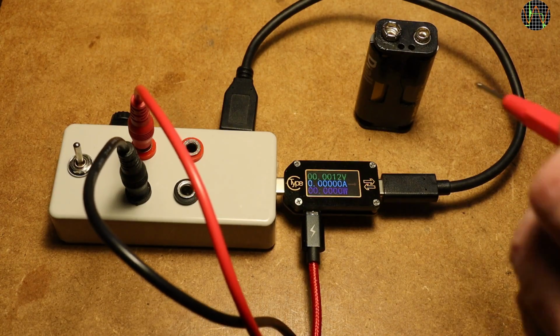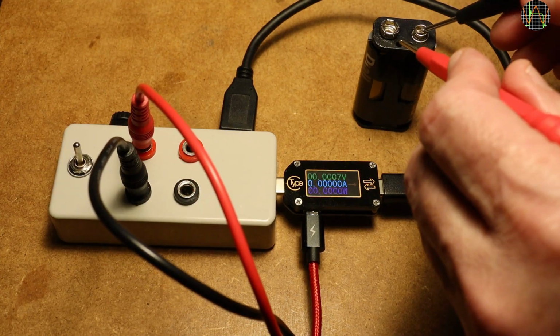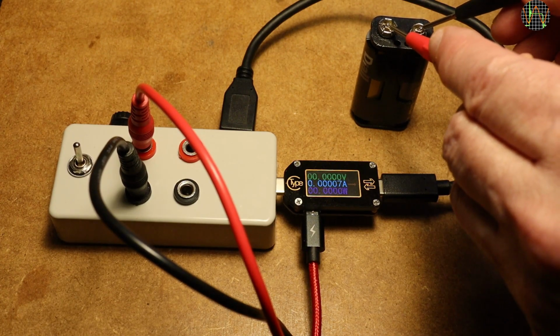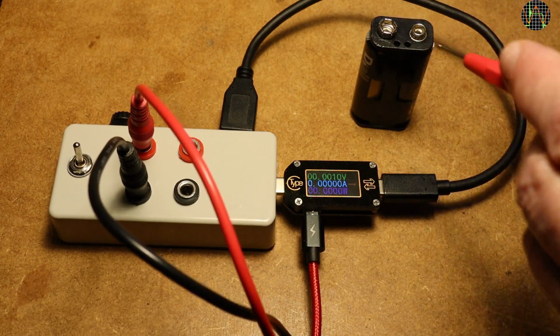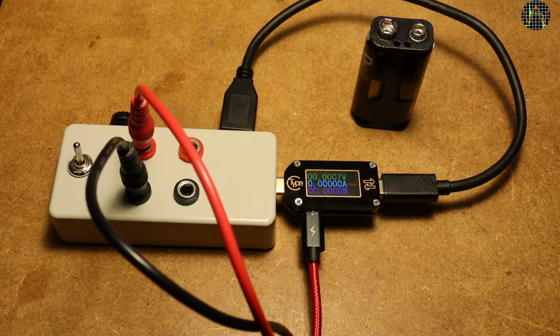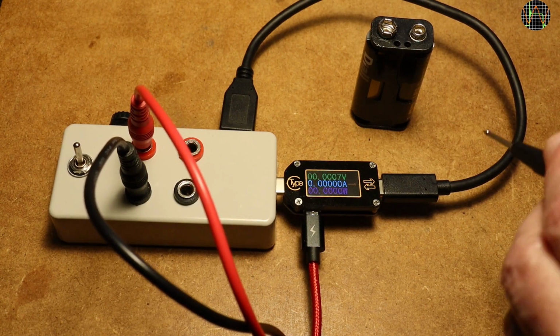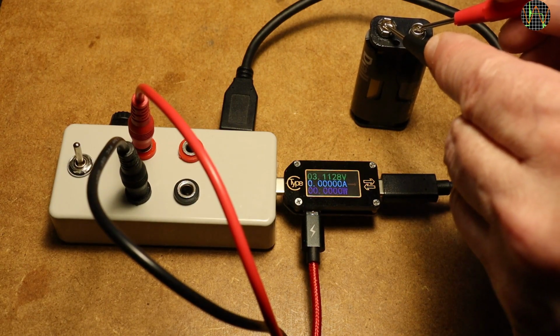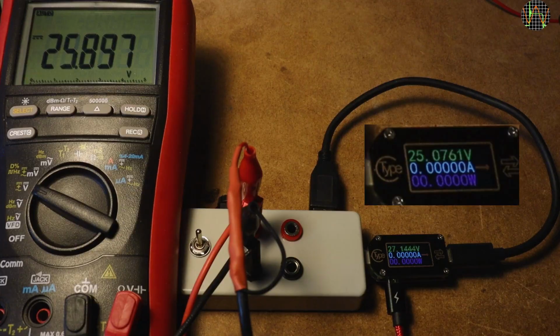At the beginning, you have seen me measuring the 3-volt battery voltage. Now let's reverse the probes to test the protection circuit. So far so good, but does everything still work? Let's reverse back to the correct orientation. Yes, no problem. And overvoltage? I'm increasing the voltage above 30 volts as you can see on the red meter, but the TC66 stays safely clamped to around 32 volts.